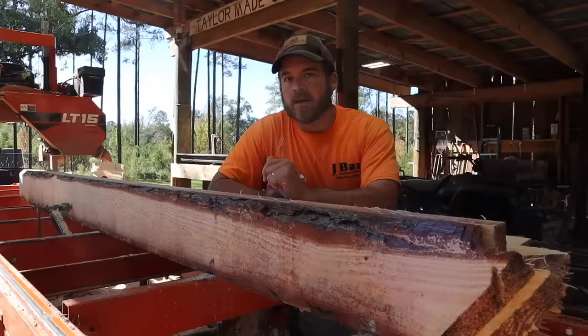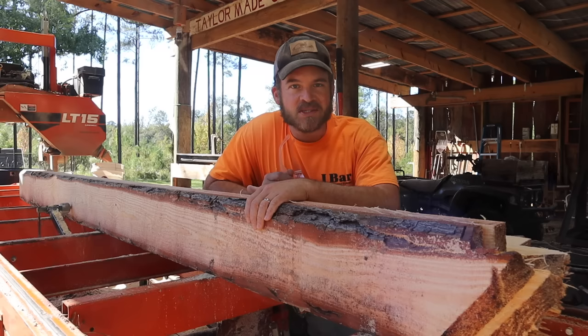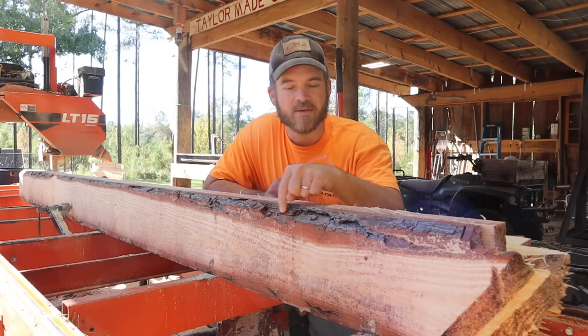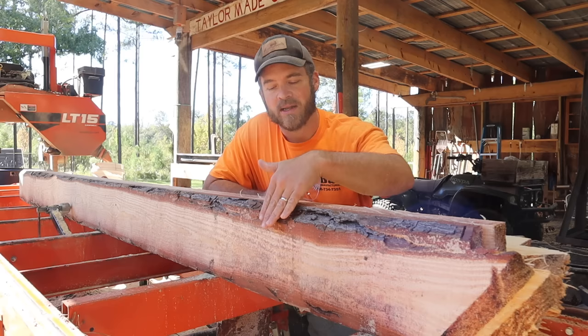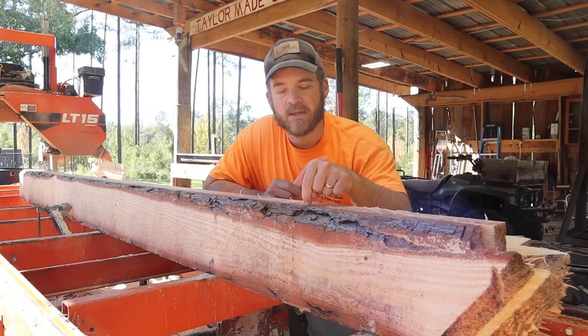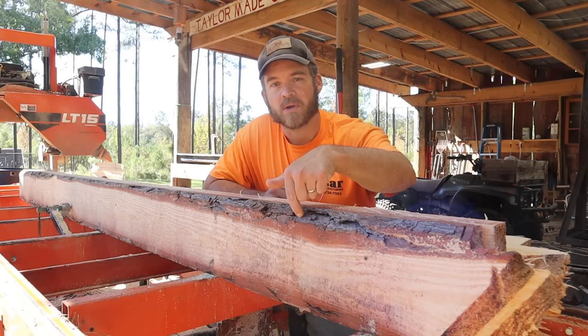Guys, one more thing before we finish up this log. I promise we'll get this thing done sometime in the next few minutes, but I wanted to show y'all this board right here. There is a ton of wane on this board. The wane is this angled section right here where the bark is, and it runs the entire length of this board, and I would like to remove most of that if I can. So what I'm going to do is drop down about an inch or so right here to get a lot of this wane off. Then I'll flip this board over and do the same thing on the other side,